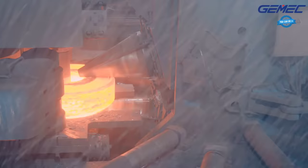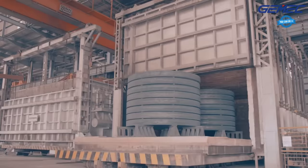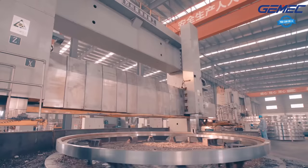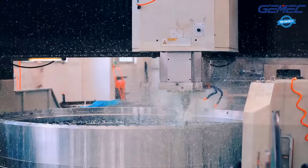After the forging process, the ring blank undergoes ring rolling, where the blank is rolled into a ring shape on a CNC ring rolling machine. After the ring is rolled, it undergoes heat treatment to improve its mechanical properties. Throughout the manufacturing process, quality control measures should be in place to ensure that the stay ring meets the required specifications. This includes inspections of the raw materials, monitoring of the machining and heat treatment processes, and testing of the finished product.